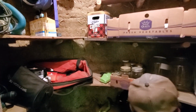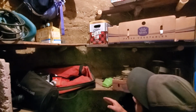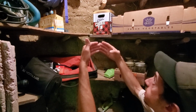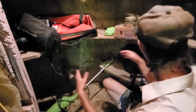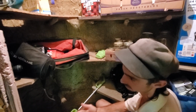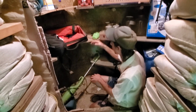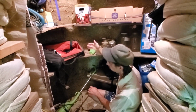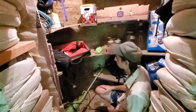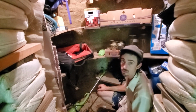It doesn't even really smell any danker than the rest of the house. It helps I don't have a ton of stuff in it. Right. And it's actually a very small cob wall. It's only like 8 inches, or maybe 10 at the base and 6 at the top, and it's round, so that helps a lot. And then behind that, I did put a 6 mil. Yep. And then I didn't put any insulation down here, and then as I came up the wall I put 1 inch and then 2 inches and then 3, so that there's more insulation above. Right. The idea is you're getting more of the root cellar effect down here. Right. And then of course I backfilled it with gravel so that it would drain well.